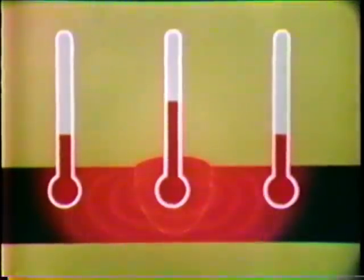Looking at the end view, we can see that the intense heat of this molten weld metal, plus the heat of the arc itself, is being transmitted to the surrounding areas. It is important to understand that while the weld metal is cooling and therefore contracting, the temperature of the surrounding plates is rising, and therefore causing considerable uneven expansion.